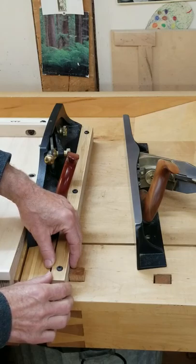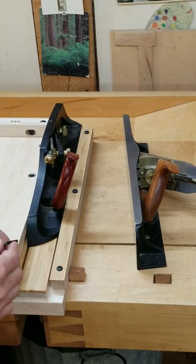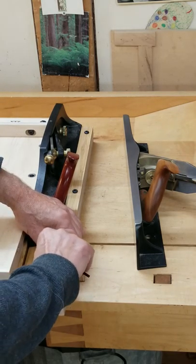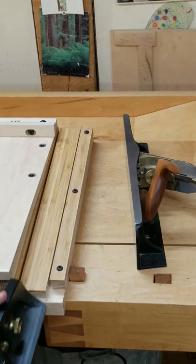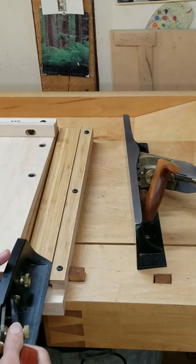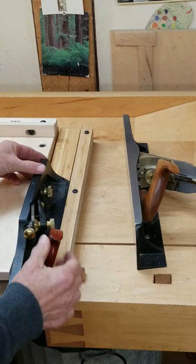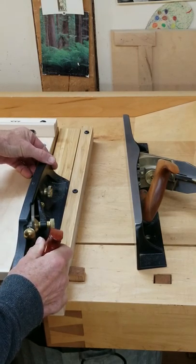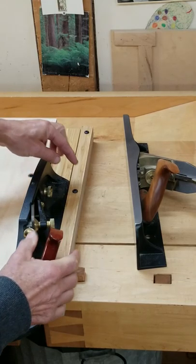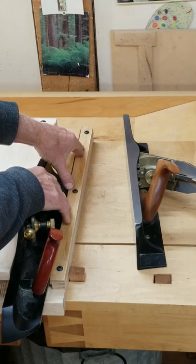You can individually pull these out of alignment just a little bit if you want, so that maybe this one could be a little bit looser to more easily feed the workpiece at the beginning. But by the time it's reached this distance, you don't want any play. Check it by pressing it — if there's a little bit of rock, adjust it again so that it's properly tightened down.